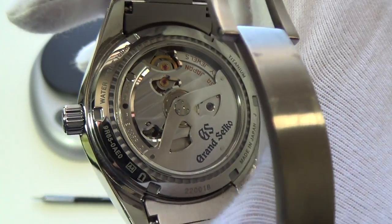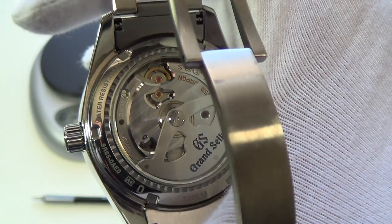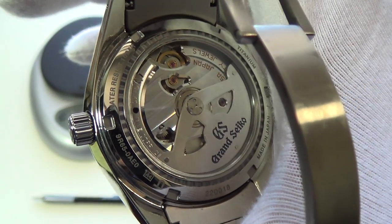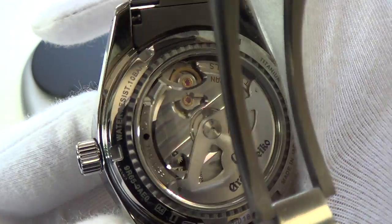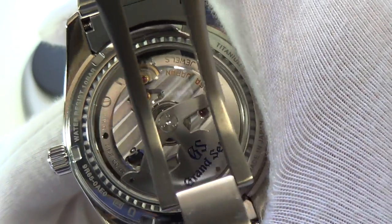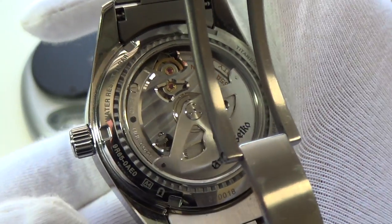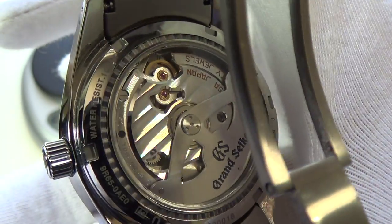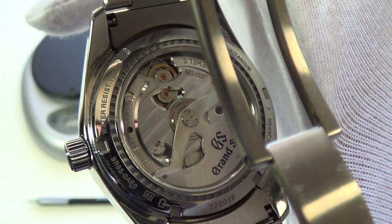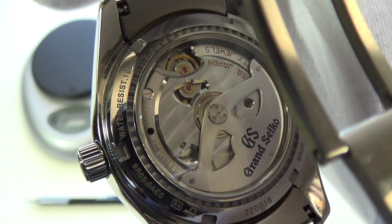So spring drive essentially, to simplify it, is a big spring. As the rotor rotates, it stores up energy in a big spring. As the mainspring unwinds, it provides the power that drives the hands. A special regulator called the tri-synchro regulator controls the movements of the hands. A small fraction of the mainspring's power is enough to drive a quartz oscillator and an IC.